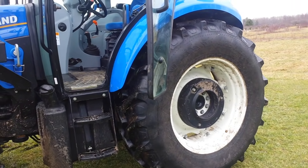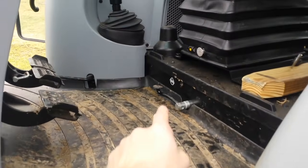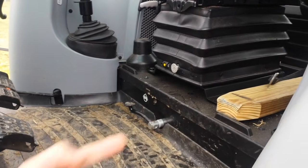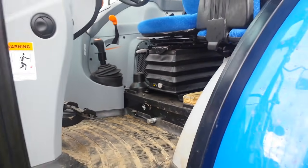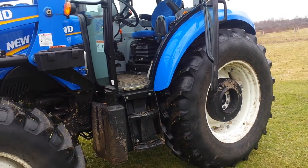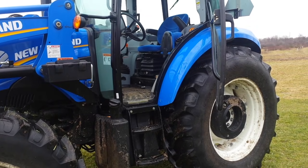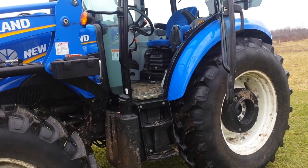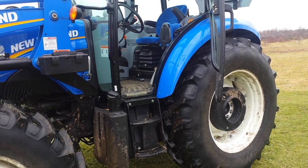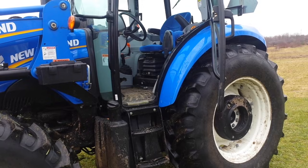So we'll go through a couple of things that were nuisances early on. This is your differential lock — you step on it and it operates a linkage underneath the tractor. When I first wanted to use it with less than 10 hours on the tractor, that linkage wouldn't work. It turns out there was paint and a little bit of corrosion on a pin in the transmission. It took me 25 minutes to find that pin, work it a little bit, put some lubricant on it, and I haven't had a problem since.